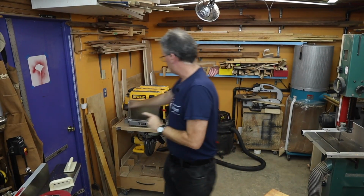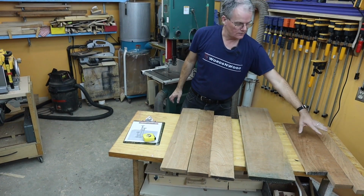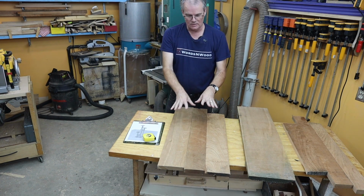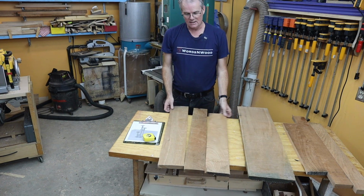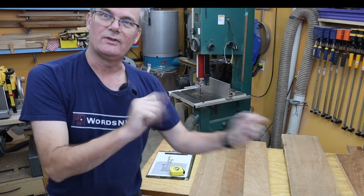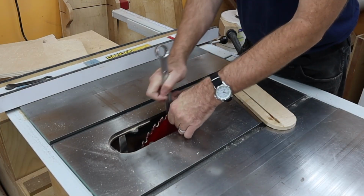One thing I have to remember is that my planer will only take pieces up to 13 inches wide. So whereas for these discs, I can glue that up and then plane them later, for this 15-inch piece, I need to plane them first and then do a perfect glue up where everything stays flat. So I kind of have 2 different things I have to do. And a good ripping blade really does make a difference.